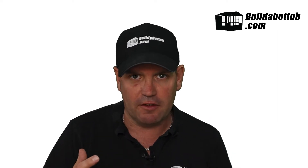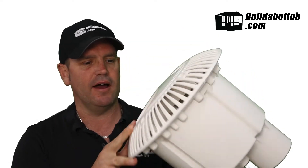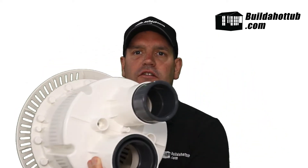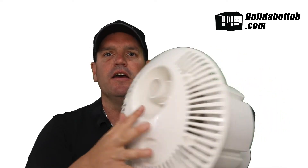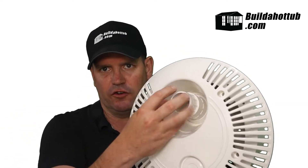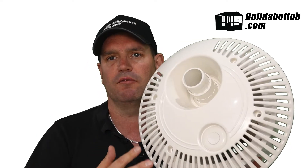So what do we do as a DIYer? There is an option that I can certainly provide, and it is a swim jet. This is a swim jet — it's quite a large, totally self-contained unit. The way it works is water is sucked in around the edge, then sent backwards through the larger three-inch pipe, which we're going to drop down to two inch. It goes into a jet pump, comes back through the returns, and out through the jet, which you can adjust. You can adjust the angle on this particular one to 15 degrees.